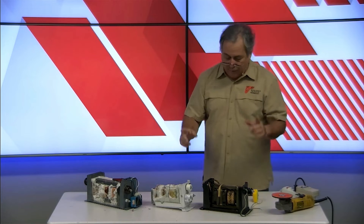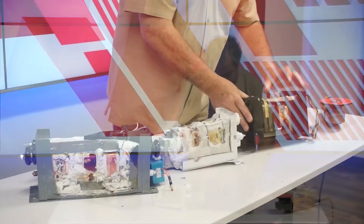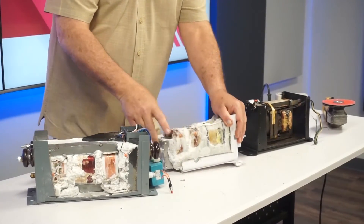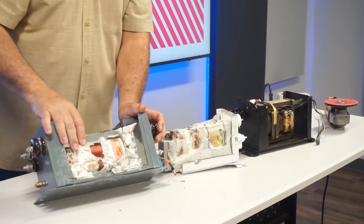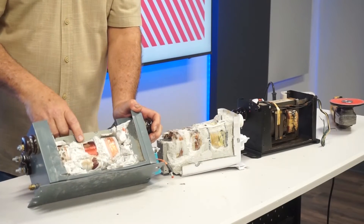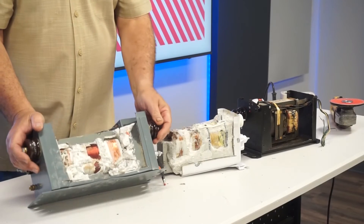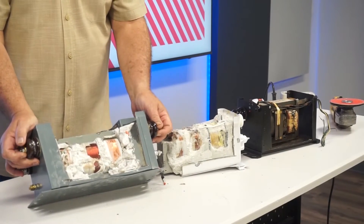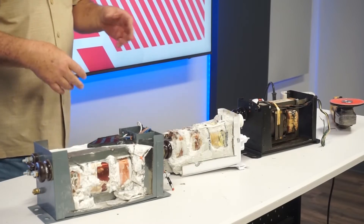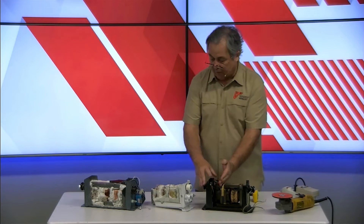So overall, let's look at the main parts of the construction. These two are built in a similar way — primary coil here, secondary and secondary. On the Ventex, we build ours differently and in the traditional way which most people have certainly accepted as being best. Primary coil in the middle, secondary coils on the outside. When power is induced, this is why it ends up being equal on both of the terminals coming out. We believe it runs cooler this way since the same amount of power is being induced into both coils — both coils are worked the same amount. On the others there's a difference in the power induced in the first versus the second secondary.